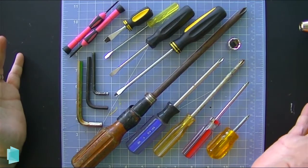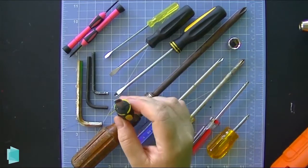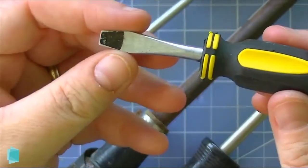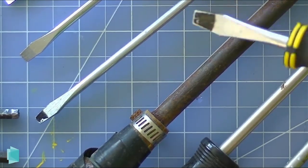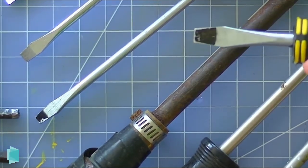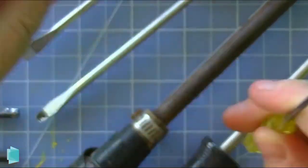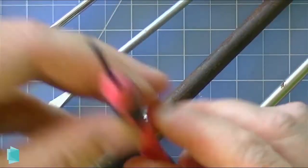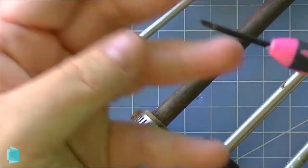These are some of our most common screwdrivers. We have our flat head screwdrivers, also known as slotted screwdrivers — the end of the shaft is flattened. These screwdrivers have been around since the 15th century and are still in use today. The only problem is they do have more of an opportunity to slide in your screw head, which can cause damage and doesn't provide as much torque as other screwdrivers. They come in two basic types: the keystone, which is a little wider and tends to be used for woodworking, and the cabinet, which is a little finer and might be used more for jewelry. And you can see really tiny little screwdrivers used for electronics, eyeglasses, and jewelry making. They come in a lot of different shaft lengths — some are great for up-close projects, others better for working at a distance.